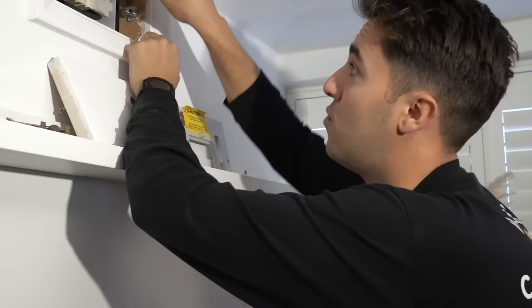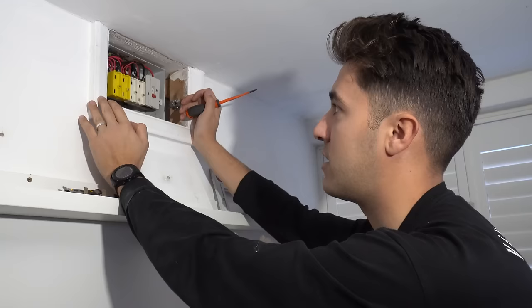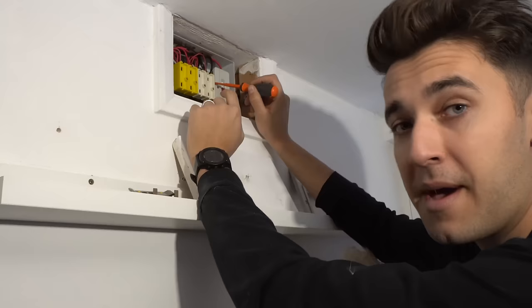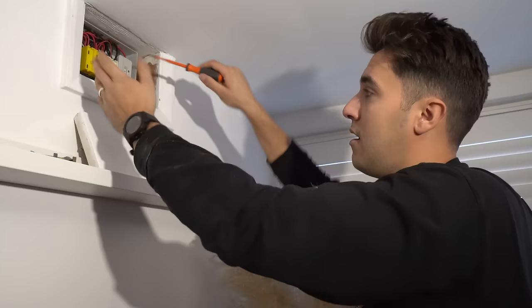All of these are completely melted out. This is literally bare copper — bare corroded copper. What doesn't make sense to me is it looks like condensation, water ingress, or a loose connection, but everything is solid and tight and was checked at the time of the board change. I was a little confused until I noticed this little stud right here — that stud is actually loose. You see, that's a manufacturer's connection there, not something that can be tightened up. It's obviously worked loose over time, and the crazy thing is I never would have even noticed that. Typically you think, oh well, tighten up every screw and nothing's going to go wrong — but that's a manufacturer issue right there.